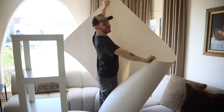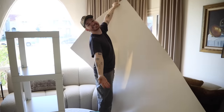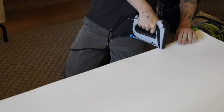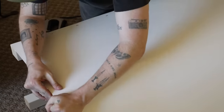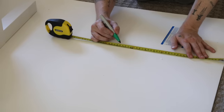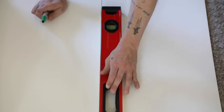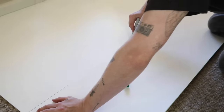The plastic sheet I'm using is called Poly Wall, available at Lowe's — I used it to create the range hood in my kitchen. It's flexible but thick, like a plasticky material, and comes in a four-by-eight sheet. I first tried bending it around the entire exterior, but that didn't work, so I measured each side, transferred the measurements to the sheet, and cut them out with scissors. Once you have the first piece cut, use it as a template to trace and cut the remaining pieces.